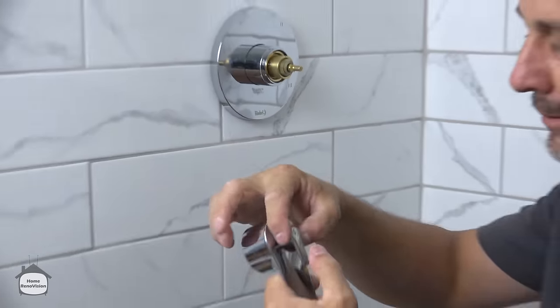Okay, Matt, so let's go ahead and turn on the water to the house. All right, quarter turn. Yeah, there you go. Now, it's important to turn off all your fixtures in the house first, or you'll never get enough pressure to bring the water upstairs. Matt's just turning everything off downstairs now. All right, here's another quarter turn. Okay, thank you.